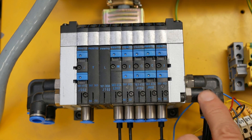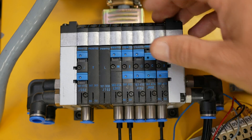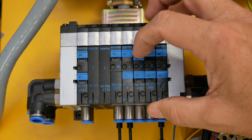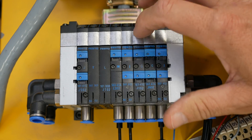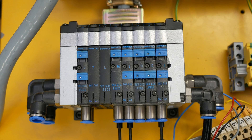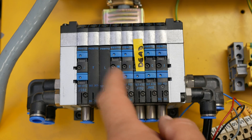I've now botched up an air supply into here. Let's try the simple one first - the C is just on/off. Let's try it with Linux CNC. That's working. What about the one next to it? Hmm, I think that's got a sticky valve. It's been controlled but the valve's obviously not moving. That's a shame. Well, if that one's not working, this is currently unused, so if I connect up maybe I can do the same job with this one.